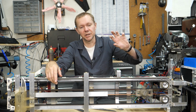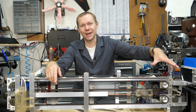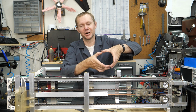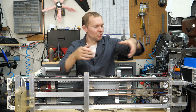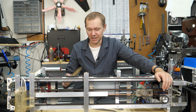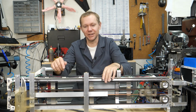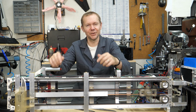And then that said, okay, how much torque? So on the stepper motors, I just kept increasing that diameter because they can't go so fast. But I would increase that diameter, and all of a sudden with that huge, like a 4-inch whatever, here I am mixing metric and English, a pulley that big would be required for a stepper motor to get a knife to go fast enough. But then once the pulley is that big, now you don't have any torque anymore to be able to actually accelerate it. So the weight of the knife would have to be some little finger knife or something, just some tiny little spike.